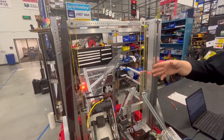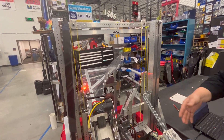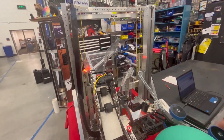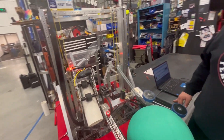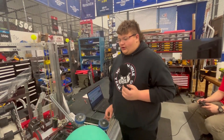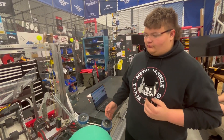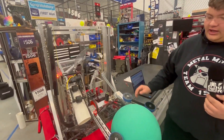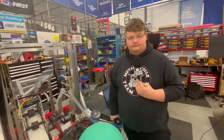The pass-through was the hardest part of the whole design because we couldn't figure out where we wanted the pulleys to go. Pulleys are usually in the center, but we had to do two separate ones so it could actually fit through. We chose the double end effector because it's more compact — when we're scoring, we can score the coral and pick up an algae from the reef at the same time.